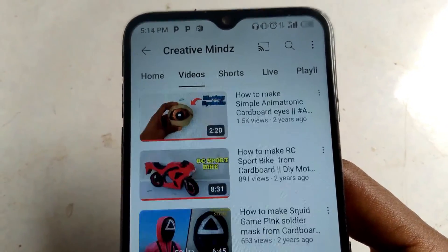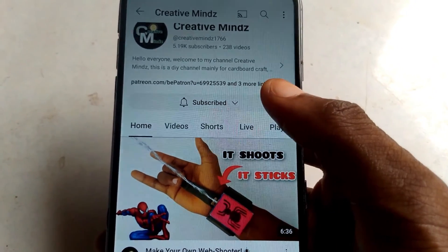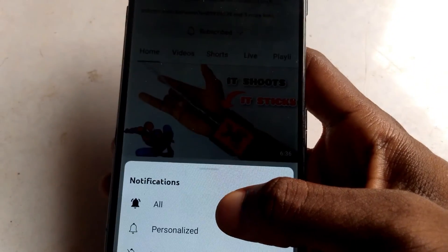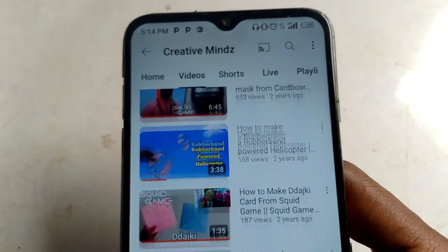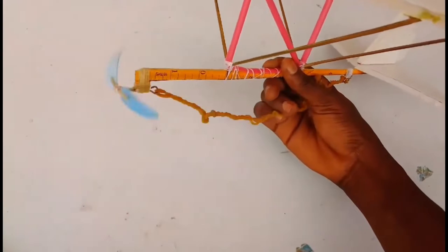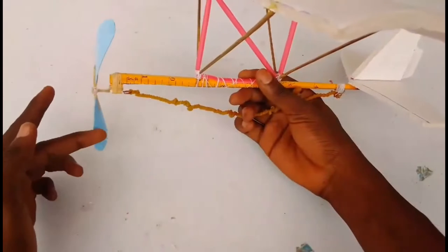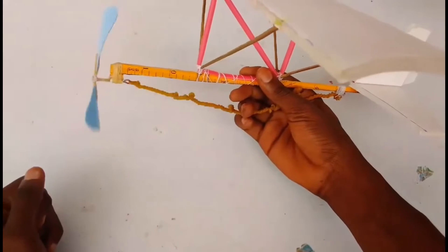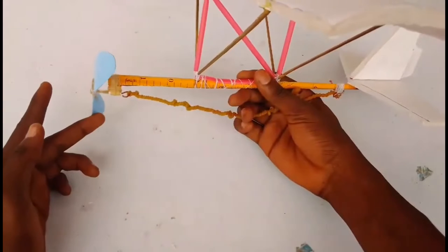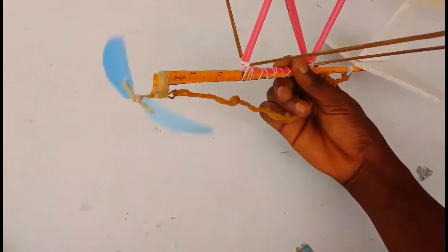I decided to take a break and go through my channel. Going through it, I found a rubber band powered plane I had built before. Since it was still powered by a rubber band, I tried to inspect it. Looking at the way the propeller was powered by the rubber band gave me an idea. Instead of the rubber band being wrapped around the axle like a regular rubber band car, it was instead twisted — and it seemed to have a lot more tolerance for how much you can twist it. Also, when the propeller was released, it didn't just reach maximum acceleration all at once; it supplied power at a more constant acceleration. That could be the answer to making this car go 10 meters.